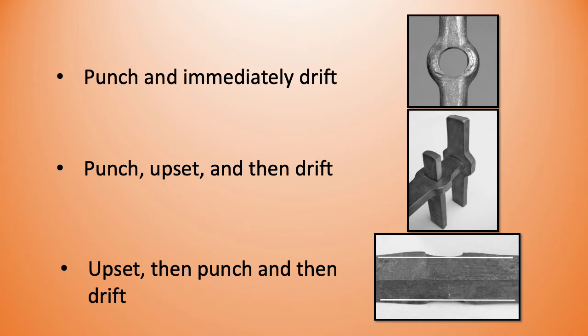In this case I'm punching across the corners on a square bar, and I want to hold as short a tool on that corner as possible. If I've got a long tool it's going to give me indigestion holding on that corner. So I'll upset the material first, then punch, then drift. You can see there has been deformation of the corner material until the punch receives resistance — this excess material above the white lines will all get cleaned up. In this tutorial I'm going to look at methods one and three: punch and immediately drift, and upset then punch then drift.